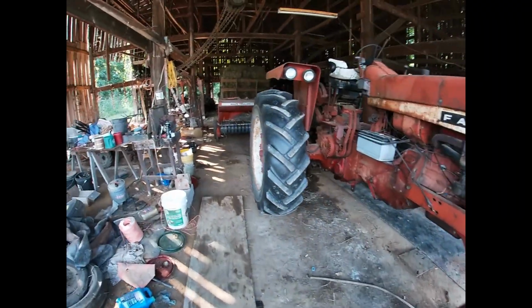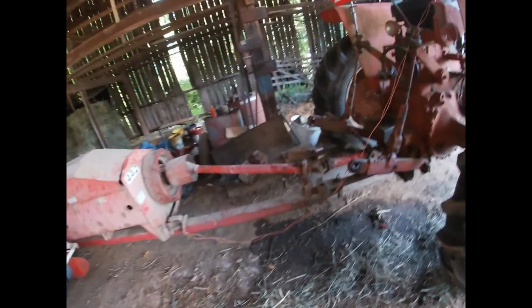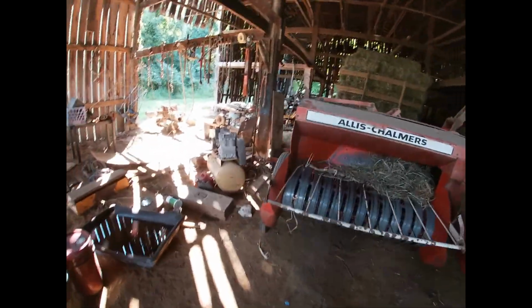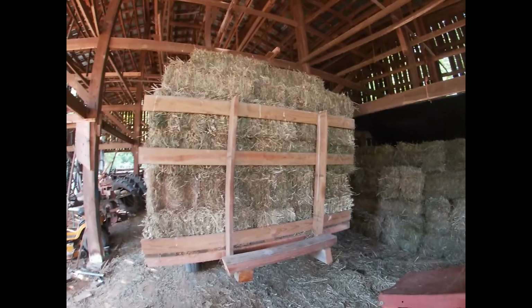Okay then. So we are put to bed, finally. We're really gonna have to do something about the drawbar situation. I mean, you can see here, there's half inch or better, probably closer to 3/4 inch right there. So it's slopping side to side plus back and forth, and that's just not working. But anyway, otherwise the thing's pretty flawless, and if you're just baling on the ground, that really doesn't matter, other than it jars the tractor around all over the place.